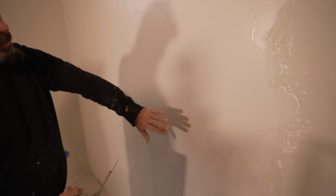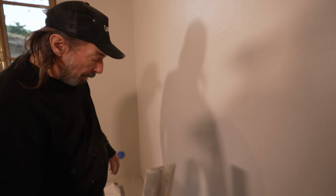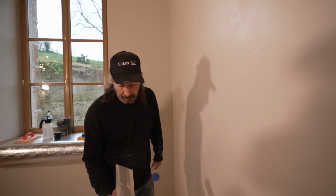And what you'll see is, if it picks it up, it probably doesn't, but when I put my trowel across it, because it's quite a big trowel, if there's any low spots, I'll be able to see it, so then I can take a piece off of somewhere and just fill that in. So that, like I keep saying, just so we get it as flat as we can.